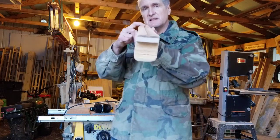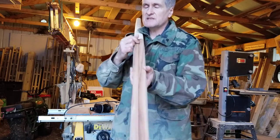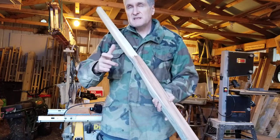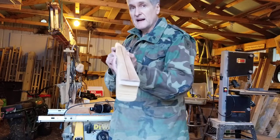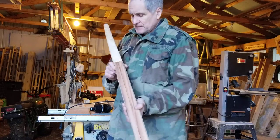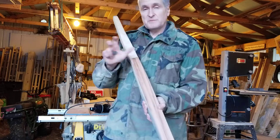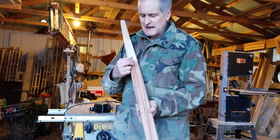I ripped a groove in here — you can see that the bolt groove is rectangular. This is a guide: I'm going to take some 80-grit sandpaper, wrap it tightly around an arrow shaft, and that's how I'm going to make the string groove round and nice. If I use a smaller arrow shaft than the finished one, the tolerances should be just perfect — use a smaller shaft with the sandpaper on it, there's a little slot factor, it'll work out nicely.